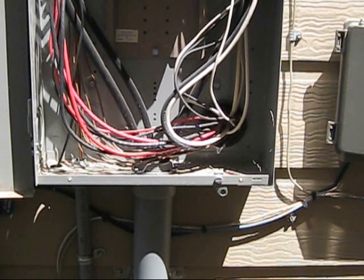What you'd like to have in that box is two breakers: one for the circuit you just took out — in my case that would be the water heater — and then one for your new breaker for your power saver. That's if you wanted to hook it all externally to the house. But then that requires buying another box, which is only 20 bucks or so for a two-switch box.